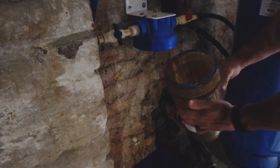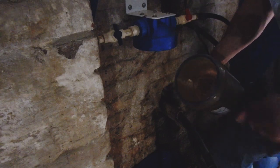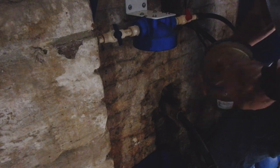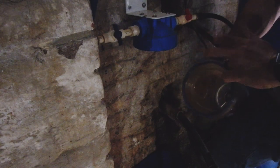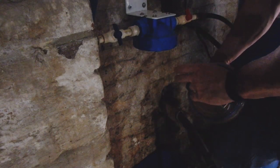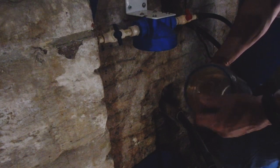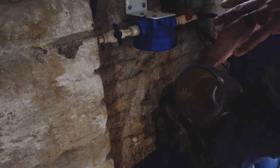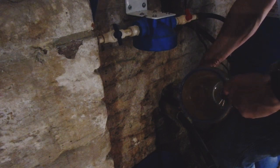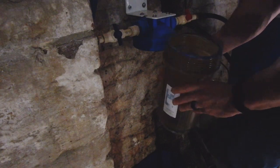You'll notice inside there's an O-ring — this blue O-ring. Every time I change out a filter cartridge, this has got silicone grease on it — food-grade silicone grease. This is important because it keeps the bowl sliding evenly on the mating surface inside so it won't leak. Just make sure when you grease this up you're using food-grade silicone grease. If you've never done it, just pop this seal out with a small screwdriver — it pops right back in — but grease it up really well, then put the seal back in.